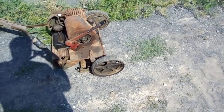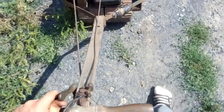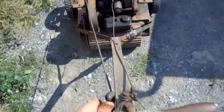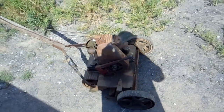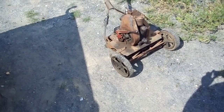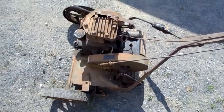The reels are powered by the front wheels — when the front wheels turn, they turn the reel. All the engine does is move it forward. This lever right here just tensions the belt and moves it forward. It's got a flat belt in there, not a B belt.